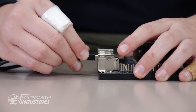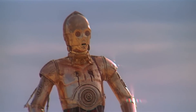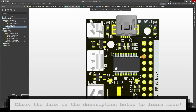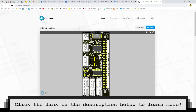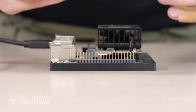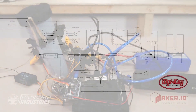The camera plugs into the Jetson, and the gun plugs in too. The camera plugs in easily via USB, but the gun, flight controller, and receiver all need something different. They're trying to talk to each other but they're just speaking different languages — if only we had C-3PO to act as interpreter. It's time to hop into Altium Designer and make our own 3PO: a PCB. Altium Designer is the industry standard for PCB design. C-3PO has arrived. It connects onto the output pins of the NVIDIA Jetson and connects all of our hardware. Finally, they're all speaking the same language that the Jetson can understand. Check out the full electronic schematic on maker.io.